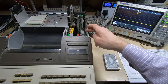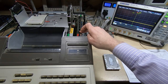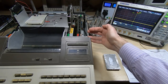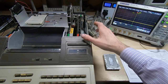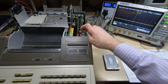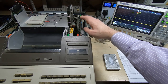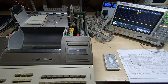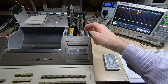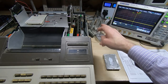The two processors are on separate buses — one's on the X bus, one's on the Y bus. To get through to the proper startup code in block 3, a lot has to work, including fundamentally both buses. It doesn't mean everything's working perfectly — there might be stuck bits or other issues — but it's a good sign that a lot of the LPU subsystem is working, and we got through to the correct code.